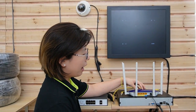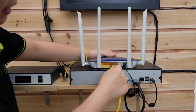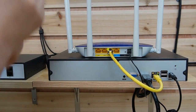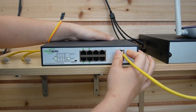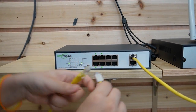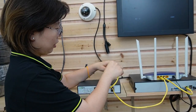Let's start the connection from the beginning. We have a monitor here, a router, and an NVR. The monitor will show images later on after we connect it with the IP camera. I'm going to use a short patch cord to connect our router with the NVR first, and then another short patch cord to connect our main network — the router — to our PoE switch to get data. You can see the indicator lights are on; it's already powered up. Now I'm going to use two short patch cords to connect two IP cameras to see if it works.